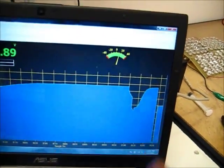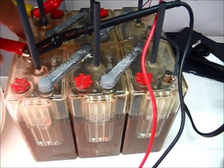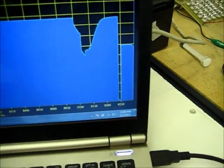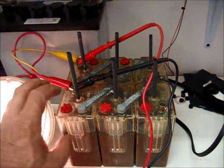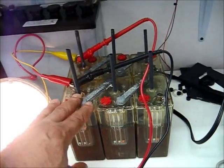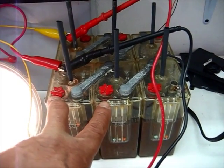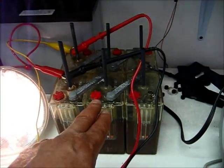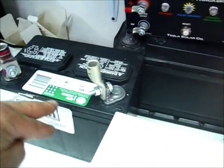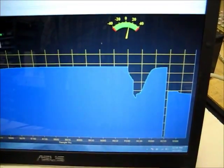So I've disconnected our little 5 amp hour cell. This is the big alum battery, and we're going to load that with this headlight so you can see. We're going to watch the curve on that. Remember, it's going to want to find some spot here since you don't get 12 volts out of it. Being that there are so many plates in here and it was formed with alum, it's going to give you quite a few amp hours. That's why I'm suggesting you use a car battery or a garden battery — you want the surface area of the plates.